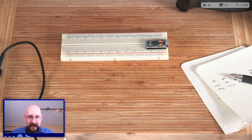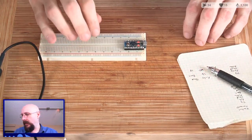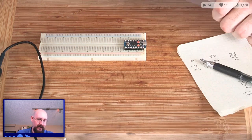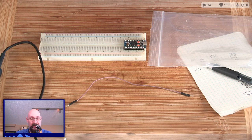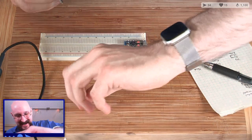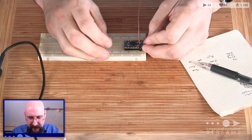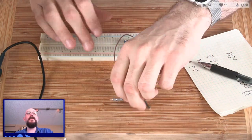Okay, that's sealed up. I guess at this point, what we want to do is flash this hardware. So let's do that. So the tutorial, which you should always read and follow. Always follow the tutorial to the letter, never deviating, because then you'll never build anything yourself and never learn how anything works. Kidding. Do read the instructions, but don't always rely on the instructions. And don't always listen to Ian. I just have a TV show, that's all. It's not even a TV show, it's just on the internet. And I'm very glad that all of you are here. All right. So we need to make sure that we've got the reset and the ground pins. Those we're gonna tap together to get this thing into apparently programming mode.